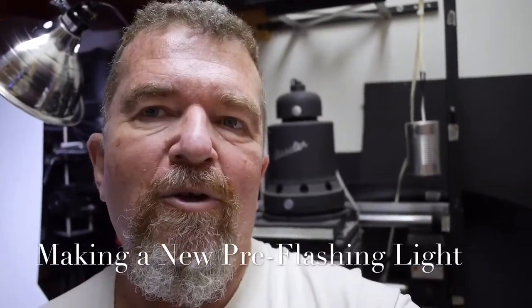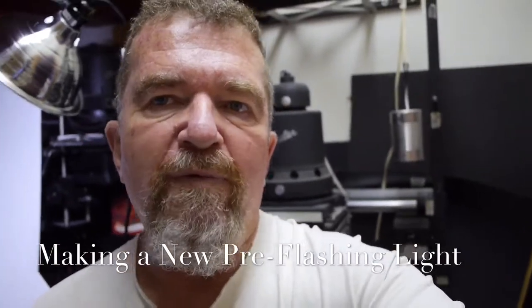Hey, this is Joe Van Cleve and welcome to my little darkroom. You probably know if you've seen my older videos, I made a video a couple years ago about this pre-flashing light source. If you don't know what pre-flashing is, this is a technique we use with paper negatives or Harman direct positive paper to control excess contrast that can happen with these paper forms of media in high contrast daylight photography, by increasing the shadow exposure without significantly changing the highlight exposure, reducing overall image contrast and giving you a better tonal range. The idea is you give a brief, even exposure of light onto the paper before you load it into your camera or film holders.